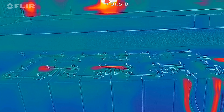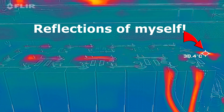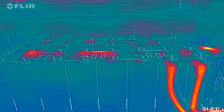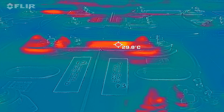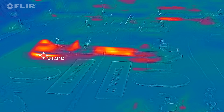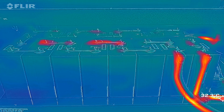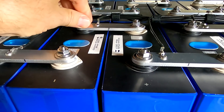Let's see if I can get the battery in full on the picture. We can see these two bus bar terminals are heating up a bit, but everything else seems a lot better. The bus bar reads 29 degrees and the terminal 31 degrees. So something is still not right with this terminal on this side of the battery. It looks a lot better than before - we don't have the candles anymore. But I still need to work these two contacts again, these two bus bars. It is only this terminal here with 32 degrees.